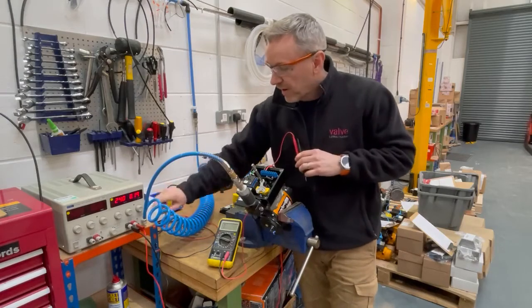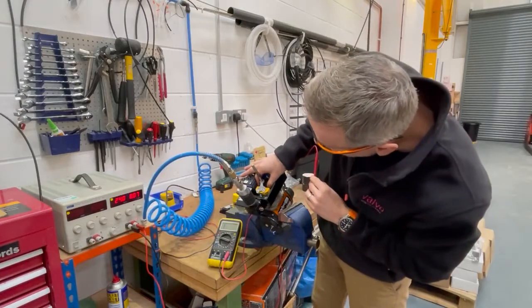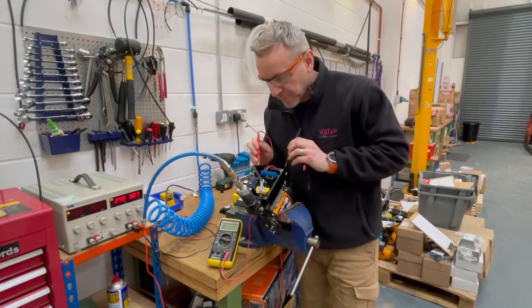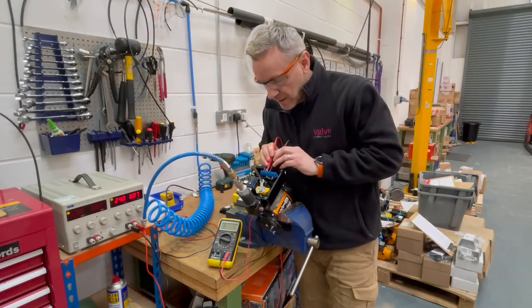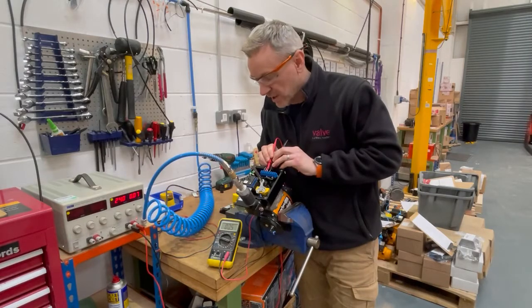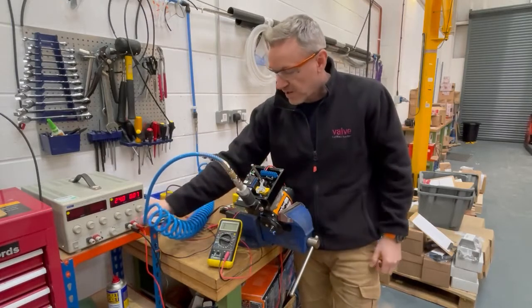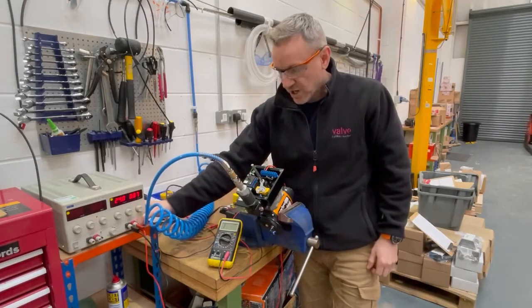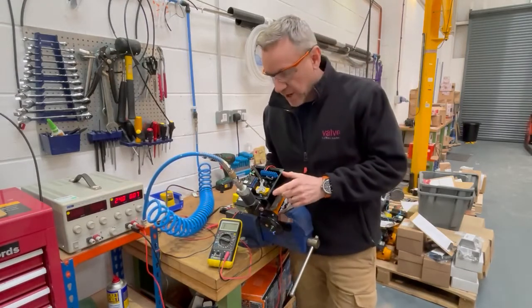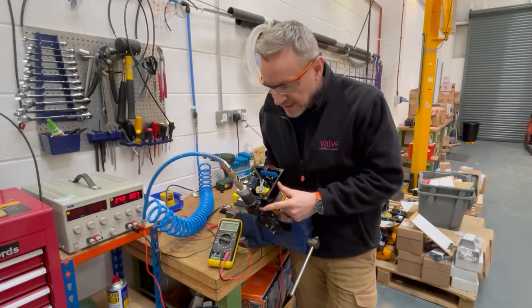We take that off and energize. Using the touch-set cam to move the striker in front of the switch, I can tell that the open switch is made as well. So quite a nice neat solution — just energize and de-energize and you can see that moving. The actuator is moving, and a really nice little thing about this particular solenoid is we've got this little tell-tale on the end here.